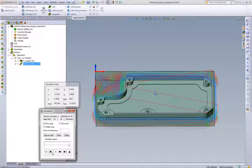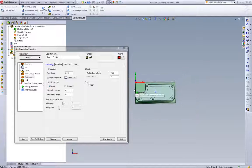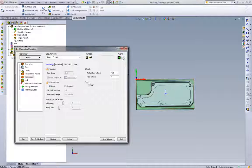So basically you got the exact same cycle time going between standard pocketing with high-speed machining and iMachining. Yet we're keeping the tool in the material the entire time. You're getting less wear from the tool entering and exiting, and it's also doing smart repositioning. Now let's do some comparisons on what iMachining's wizard would tell us to run. Because now that we're actually doing a step over control toolpath, we can take this thing in one depth of cut. Not a problem at all.